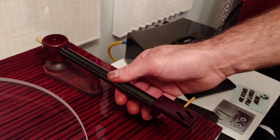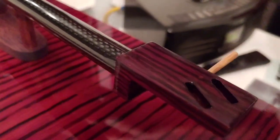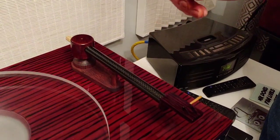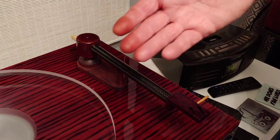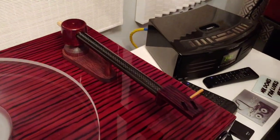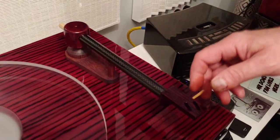None of this has been wired up yet - we're going to use pure silver wire. The reason I've opted for the uni-pivot first is because it's the easiest way to make a tonearm. The problem with a uni-pivot arm is it takes a lot of setup, and if not done properly it can put a lot of stress on your cartridge and on your vinyl records. But I'm 100% sure I can get this really good. We've pulled out the RB250 just to try this out.